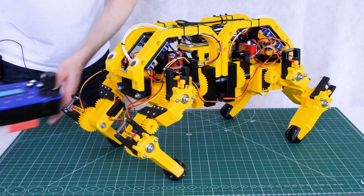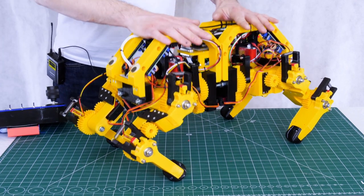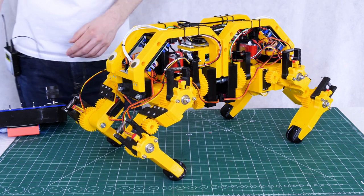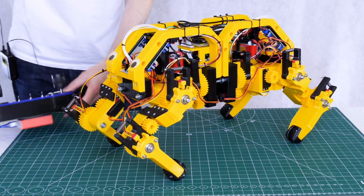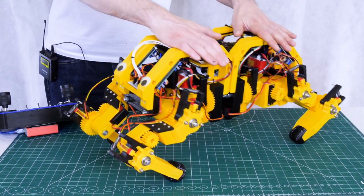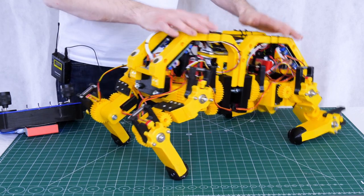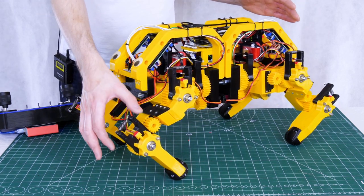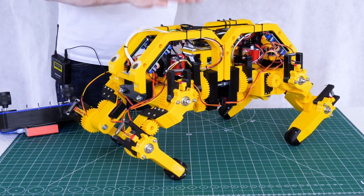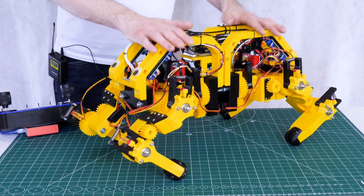I've now tied up the remote so we can control the modes of the robot. We should find there's no compliance here, just the springs. If I turn on one of the switches, compliance is back on using those hall effect sensors to read the positions — essentially how much the spring is getting stretched and how far the magnets are from the hall effect sensor. We're using that to actively drive the joints to give it compliance. That works fine.